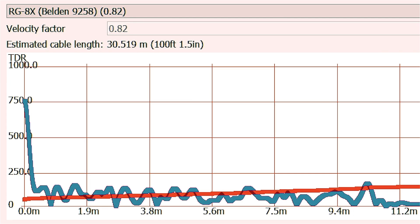So I swapped it around — I put this end into the nano-VNA and this end into the antenna. Now it showed a length of coax of 100 feet, but it showed the distance to a short at 100 feet. So you've already guessed what's wrong.